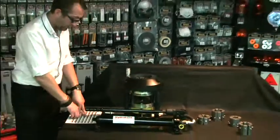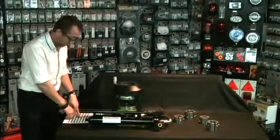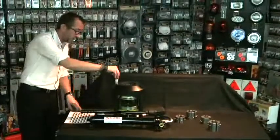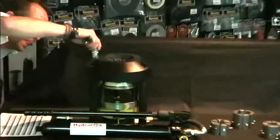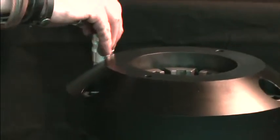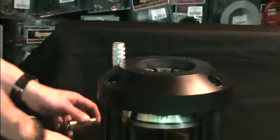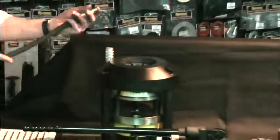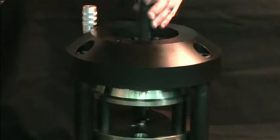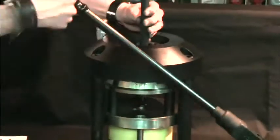For this diameter, I need a finished diameter between 20.1mm and 20.4mm. I would wind the dials down to between 4.1mm and 4.4mm — in this case, approximately 4.2mm. I'll insert the ferrule into the pipe, load into the machine, and begin to swage.